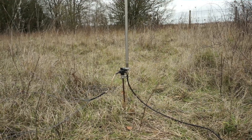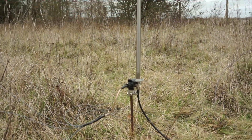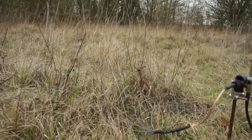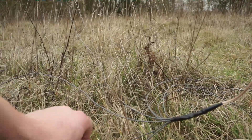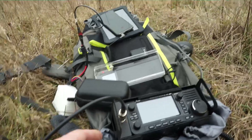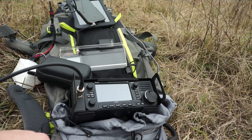I'll give you a really quick overview of the setup now I've got it all rigged up. There's the ground mount, antenna on the top which you saw me tune for 20 metres, so it's vertical. I've got six radials — a couple of metres long each — all spread out across the floor, connected on with a clip. RG58 cable goes back into my radio. I'm using the Icom 705 today. I'll get on there and see if I can make any contacts.